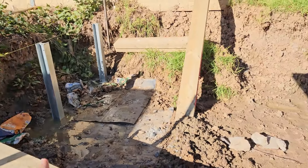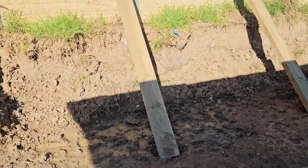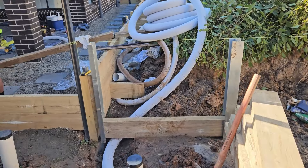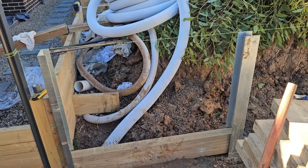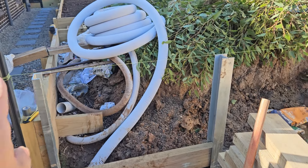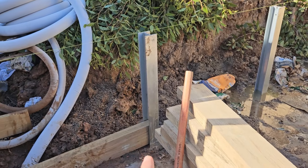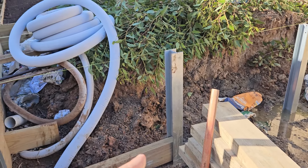The other one needs to be engineer-stamped and checked. Not talking about it, but any retaining wall over 600mm height needs engineering details and inspection to confirm and approve it. So what we did first: we set the line, dug the hole, and installed the steel post — 2.22 meters deep into the ground and one meter on top.